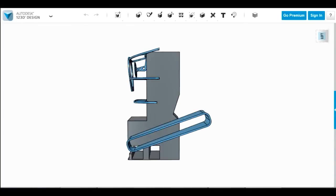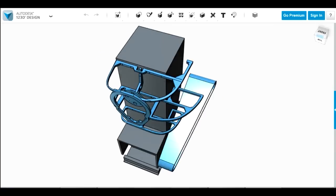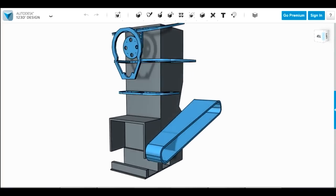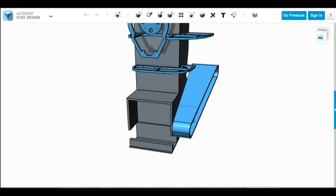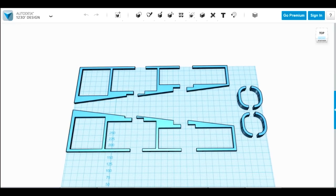I've expanded my representation of the leg block in CAD so I can design the other frame parts. The first piece I wanted to work on was this weird side panel — a sort of heel piece sticking out and upwards at the back, similar to the one in the Age of Ultron trailer and the Hot Toys figure. It's about 600 millimetres long. There's a toe and back toes to go in front and behind. It's quite a big print, so I've broken it down into more frame parts, split into lots of full bed prints, and I need to print it twice.